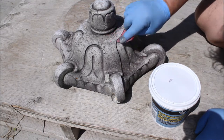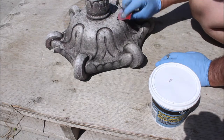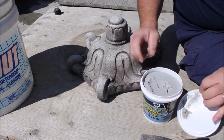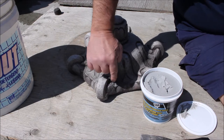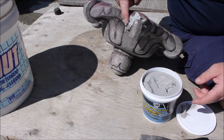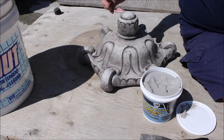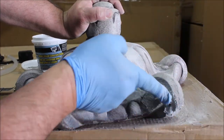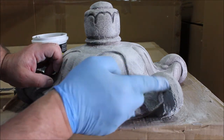Surface preparation will give us a good idea of what we're looking at in terms of repair of the weathering damage, but this material will also work to fill those large gaps. This material works best if it's applied in multiple thin coats with plenty of dry time in between. Now on our third application, we're starting to get a better idea of the shape it's going to take and how much more will be required.